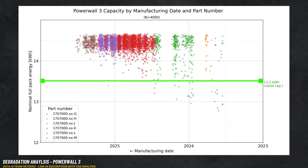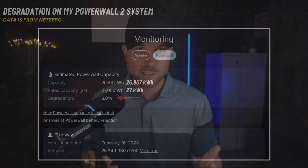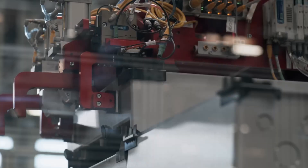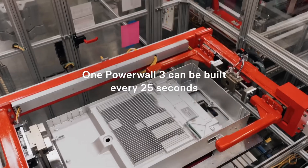I know Powerwall 3 is a new product, so the sample size is still pretty small. In the description below, I will include an interesting analysis from NetZero on Powerwall energy retention over time. For some additional context, my two Powerwall 2s were installed three years ago, and they have seen less than 4% in degradation — about one kilowatt hour total — and I worked them pretty hard each day. The Powerwall 3 upgraded its chemistry to LFP, lithium iron phosphate, which is a more durable, safer, and longer lasting chemistry than the older NMC that I have on my battery.